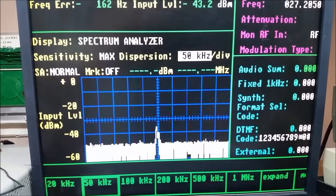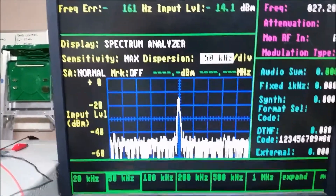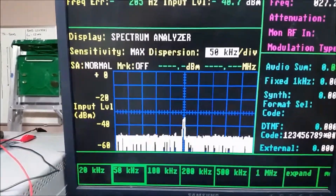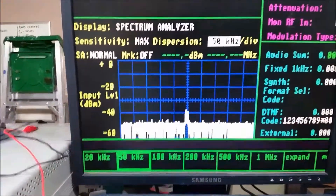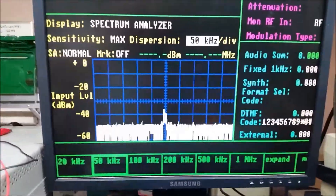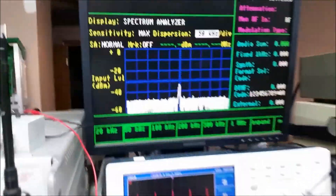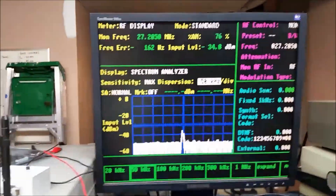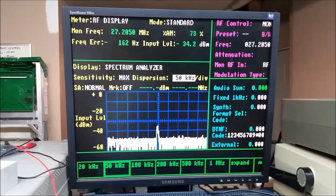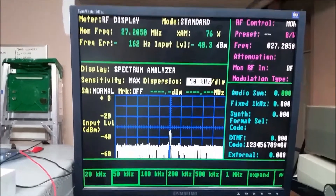You've got a CB weak noise, there's the amplifier output — it's not even on the scope before. Listen to how clean and crisp it is. As you notice, when the preamp is taken away you hear your normal static as you normally would, and you do not hear that static being amplified with the signal. All you're hearing is the tone. This is a true preamp amplifying on 27.205 MHz — channel 20, right in the middle of the band.